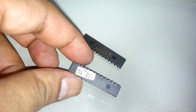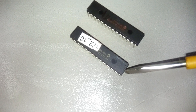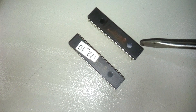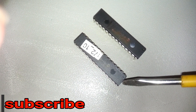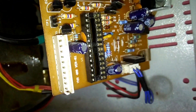Now let me tell you how to identify which way you need to connect the IC. On one side there will be a little notch, and the pin counting starts from one, two, three, four, five, six from that side. You need to match the IC's notch to the socket's notch.